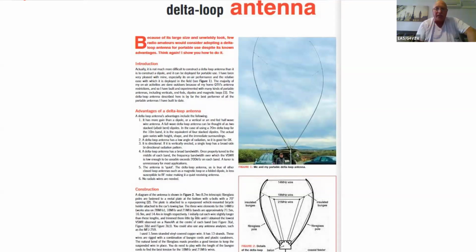I would say Nick raised a fantastic point about the telescopic fiberglass poles. And yes, I think you've got to get maybe the pole that's slightly longer. So for your antenna, I would be looking at 9-meter length poles to allow for that bending.